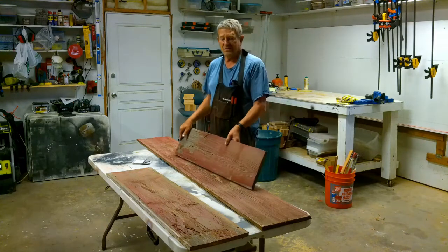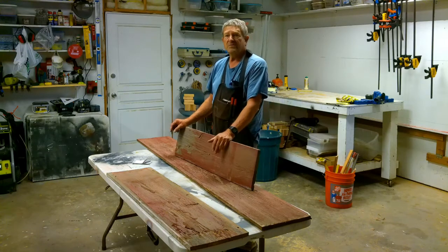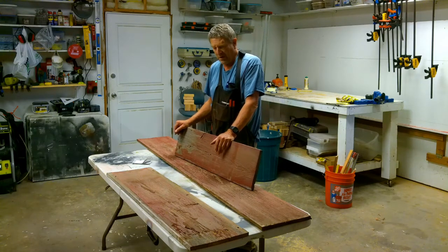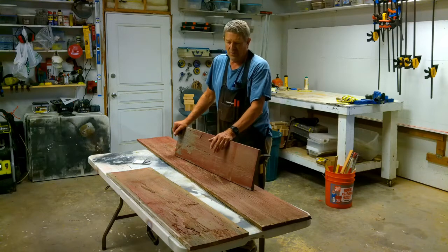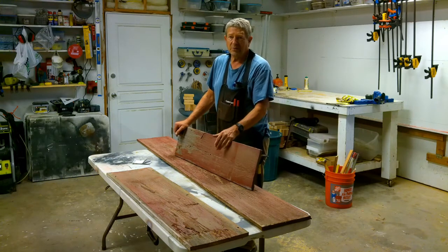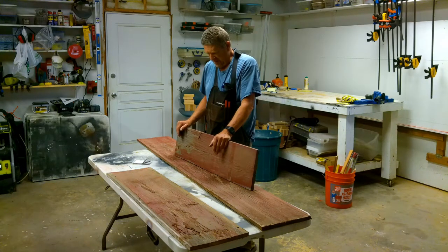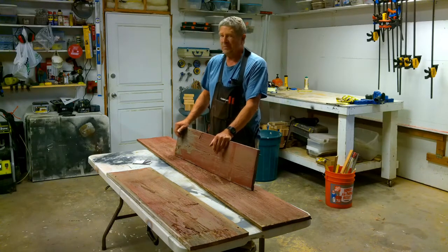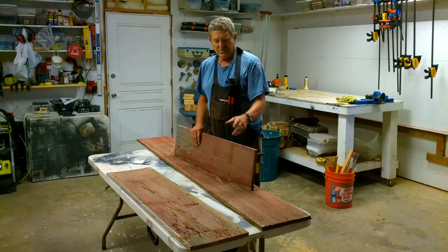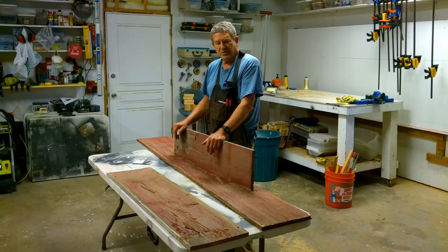All right, so now it's finally time to build the fronts for the 2 drawers in the coffee bar. And since the coffee bar has more of a red theme to it than the rest of the kitchen, of course I'm going to use drawer fronts that have a little bit more red in them. So this is what I've picked out of my stock. One of them needs to be 9 inches by 28 1/4, and the other needs to be 14 1/2 by 28 1/4. So I'll have to rip one and put the 2 pieces together with pocket screws, but that's no biggie.